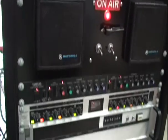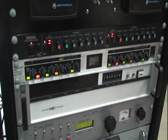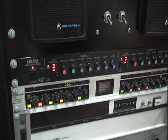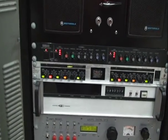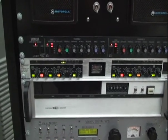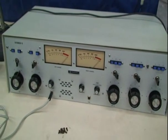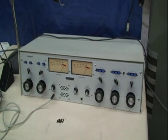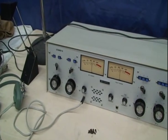To prevent overload, we've got some audio processing gear: an Ultra-Gain Behringer microphone preamp and a Yamaha compressor-limiter to keep from overdriving. The signal goes from the microphone into the Behringer tube preamp, then into the compressor-limiter, and then into the studio console. As you can see, the meters are going right where they need to be — just a little bit in the red to give a good sound out of the transmitter.